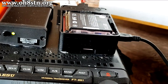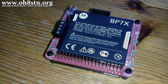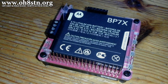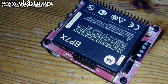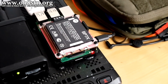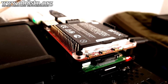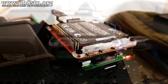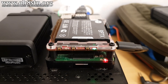Let's talk about external DC power for the Raspberry Pi. You've all seen how my Raspberry Pi is kind of funny looking - it has the PiJuice hat sitting on top of the main board. There are a couple of different reasons for using the PiJuice hat. Firstly, it's got the real-time clock we talked about in the last segment. Secondly, it has a built-in battery to power the real-time clock and the Raspberry Pi. It also has an external port so that we can power the internal battery or use an external battery to power the Raspberry Pi. It's also got built-in battery management so you can assign different tasks to happen at a certain battery voltage - for example, shutting down or going to sleep when the battery reaches a certain level.